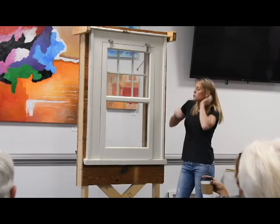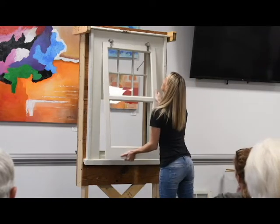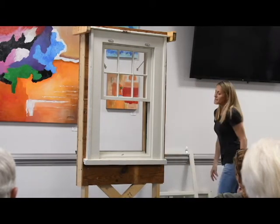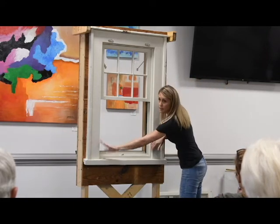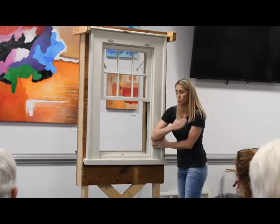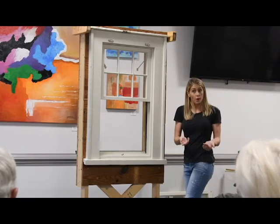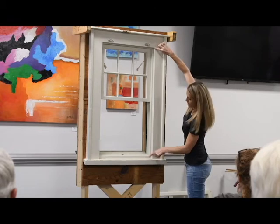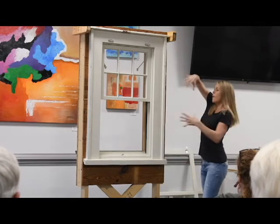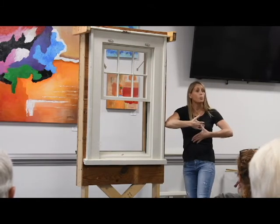Now, if you had shutters on your home instead of storm windows, you can also have a storm. One thing to note, and why some of them look janky, I call them janky, is that your shutters were meant to fit inside this section right here. When you're buying shutters, there was some hardware that fit right here, and they just swung right in, closed. If you want shutters, you should try to make them look operable even if they aren't. That's how you size them: they should fit exactly in between here, not like here or here, and they shouldn't be nailed way out here. They'll be on hardware, and they will actually fold out, and you can get a shutter dog, which is a little piece of hardware that holds them back.